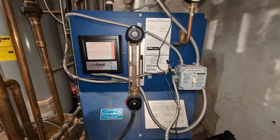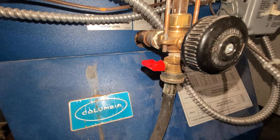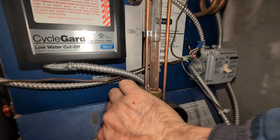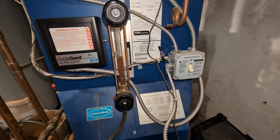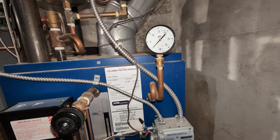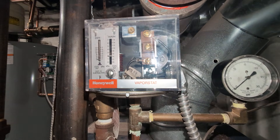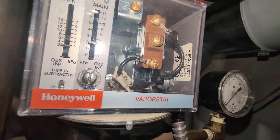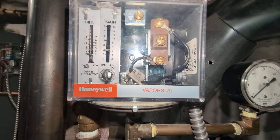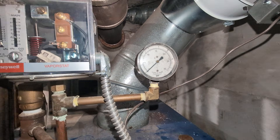With the typical steam boiler, there's our sight glass with top and bottom shutoffs, and there's our usual signature dish — the sight glass drain valve to keep it reasonably clean. The power switch and your 30-pound gauge are here. Because this is a two-pipe steam system, we have a vapor stat. We first had to get away from the mercury type since they were no longer being made and were becoming hard to find. This one is set as low as it can possibly go — four ounces — and there's our low pressure gauge to keep track of such things.